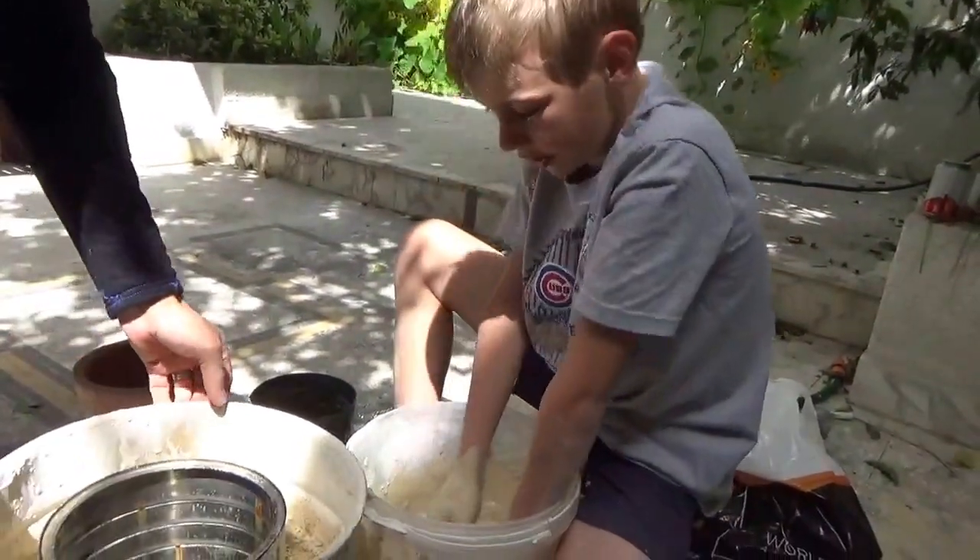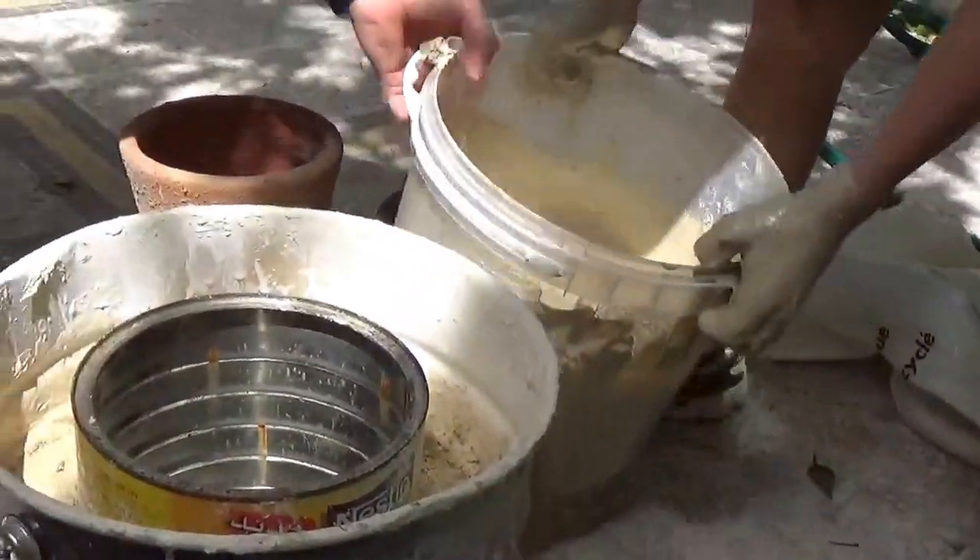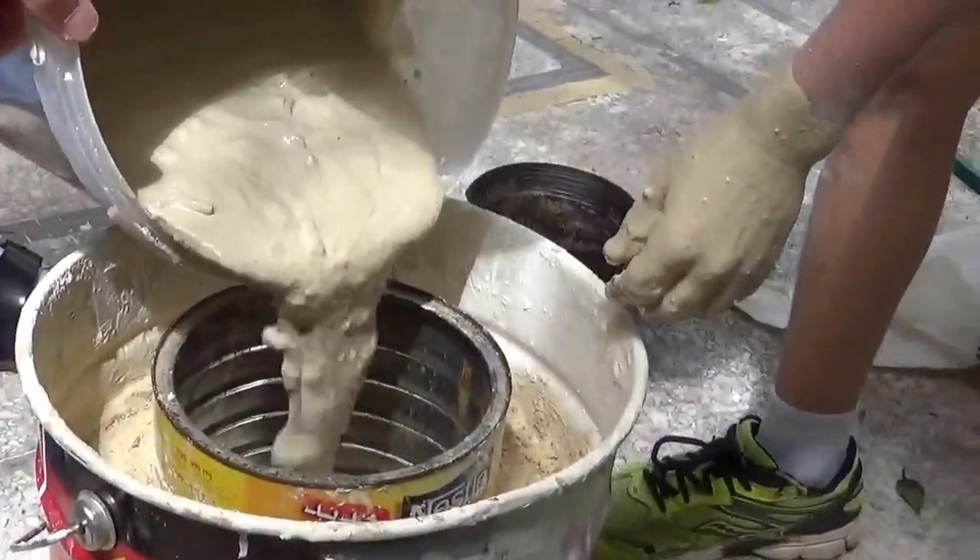Now that you have the plaster mix in, make sure to put in nine cups of sand and plaster with about six cups of water. Make sure you pour it soon — it's going to start to set. Pour it from the side, then pour a little in the middle just to make the base a bit stronger.